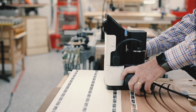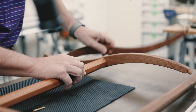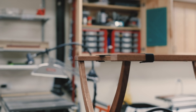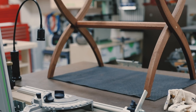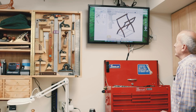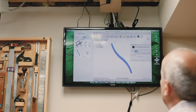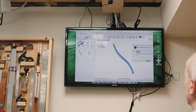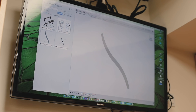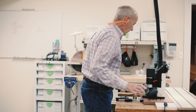I really appreciated the space consideration of Origin as well as the simplicity. I tend to start on a laptop and get things close, then come down to the shop. So this is a luggage rack — a design I received as a gift when we were married. I drew one of the legs in Fusion from Autodesk, replicated that leg, created the cross braces and the center connecting post. If I want to export that to Origin, I can pick the leg, come up to the Shaper plug-in, export a face, name it, and then import it via Wi-Fi into Origin and cut that profile directly on tool.